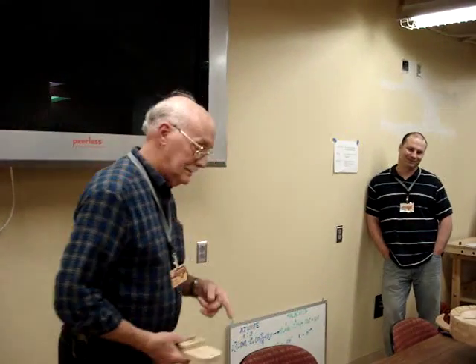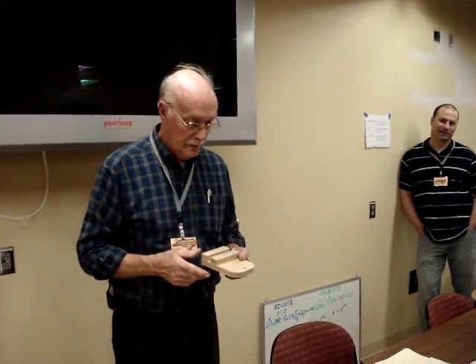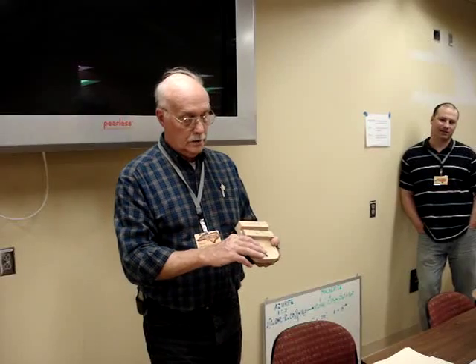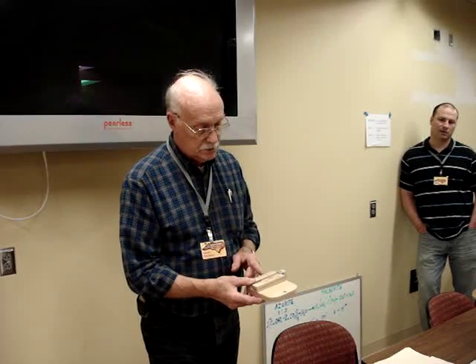How many did you have to make before you got the good one? That's the good one. The other thing you'll really like is a number two Morse taper — they're hard to turn. If you make a jig, you take a block of wood and put a piece at the end of it, then take a number two anything off your tailstock, set it against here, put the other block against it and nail it on. Then you could put marks on here — this is two and a half inches, and this is an inch and a quarter.